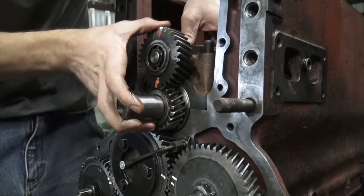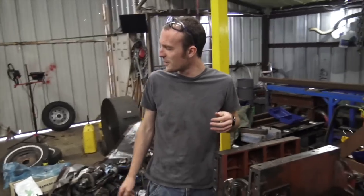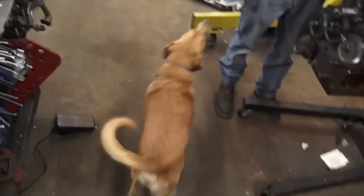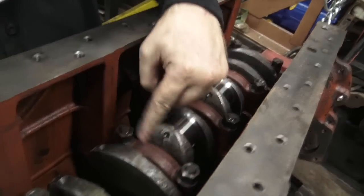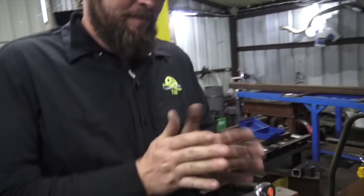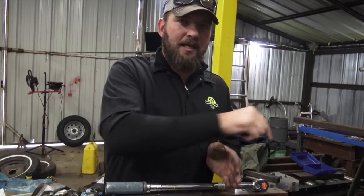Lucky's stuck in here because he wants to run around and bark at the neighbor dog. Say woof, Lucky! Good boy. Alright, 22 millimeter socket. Start in the center and torque this one, then come over here, then work outward. When doing the main caps, start in the middle and tighten first, then crisscross to the outside to walk it down.